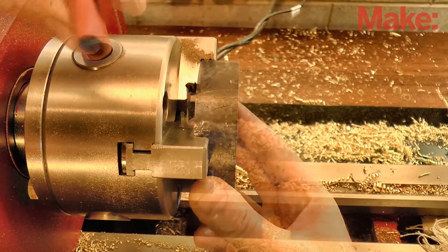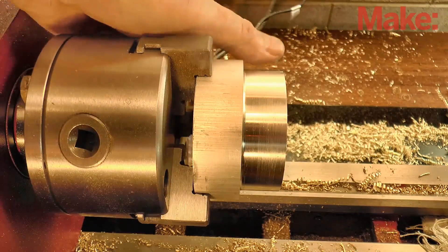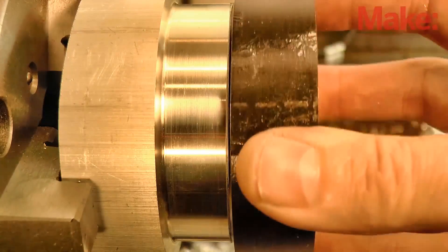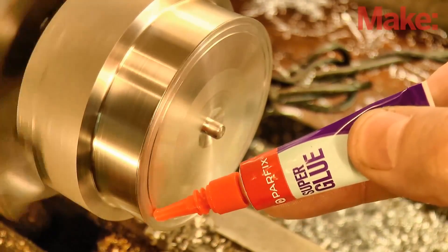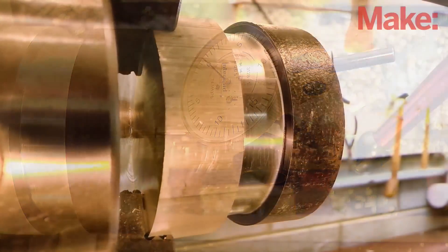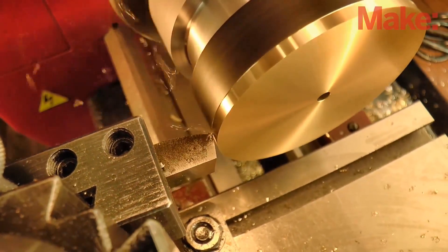That's one side complete, so remove the work and now load that off cut of aluminum, because we're going to make one of my favorite shop accessories - a custom super glue arbor - and we're going to use it to hold the wheel for the next few operations. Face the stock and then form a short spigot on that front face. Make sure that the spigot is a close fit with the hole we just reamed in the flywheel. When the fit is good, form a few small grooves near the perimeter, apply a small amount of glue, and then using the center spigot to locate the work, push it into place. Within a few seconds the glue sets and the work is now re-centered on the bore of the part. So now we have a very convenient way to access not only the front of the work but also the back and sides, meaning we can form all of the remaining surfaces and know that they'll be concentric.